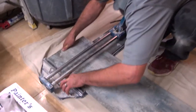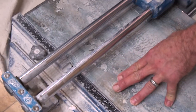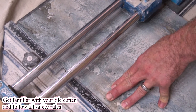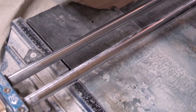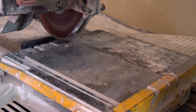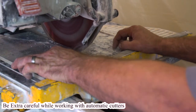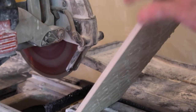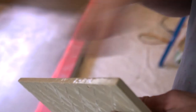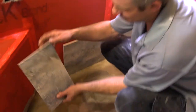This arrow right here represents where that wheel will cut, and that's my mark. Then just lightly push down. It had a rough burr on it, so I shaved it off, because sometimes that doesn't make a super clean cut.